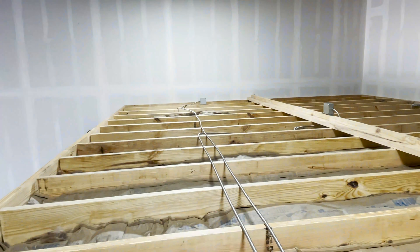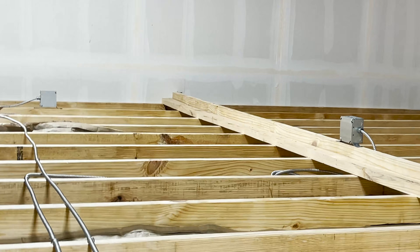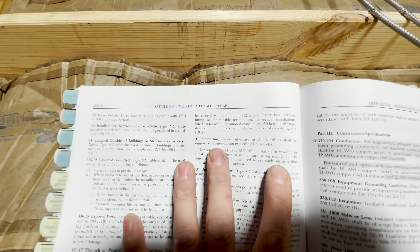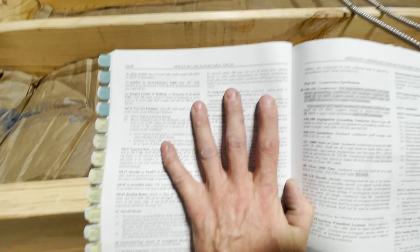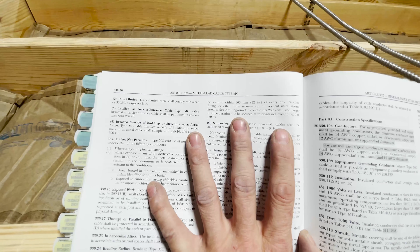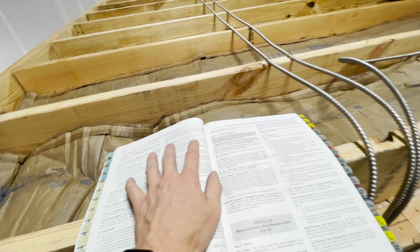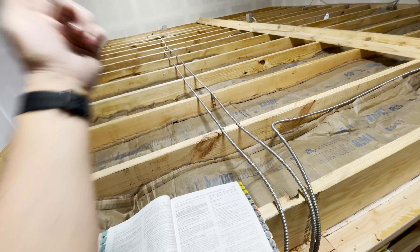Down inside this wall there are switches — within 12 inches I'm secured down there. You can see a strap right there on the top of that 2x10 — within 12 inches of that box. I've got a coil of slack because I'm going to use that for more cans later, but I still need to go back and strap the rest of that. Same thing over here — 12 inches on the back side of that rat run, there's a staple right there, so we're within 12 inches. In vertical installations going down a wall, listed cables with ungrounded conductors 250 kcmil or larger shall be permitted to be secured at intervals not exceeding 10 feet.